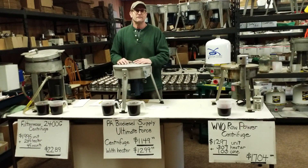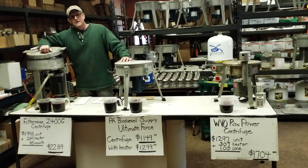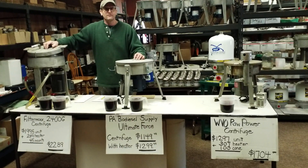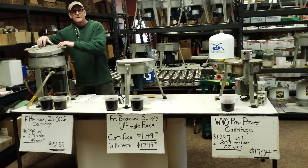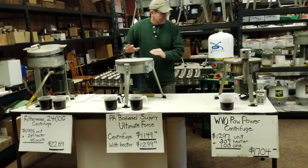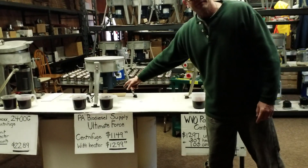We try to be honest with our movies and our products. There's no need to spend that kind of money on the competitors' units. If it's a higher G-force, just run your oil slower — about a gallon slower — and you're going to get the same cleanliness. You can buy two of my units for what you're paying for one of his, do more oil, and get it cleaner. At a five-gallon feed, his bowl holds you for less than a minute and a half — ours is six minutes.